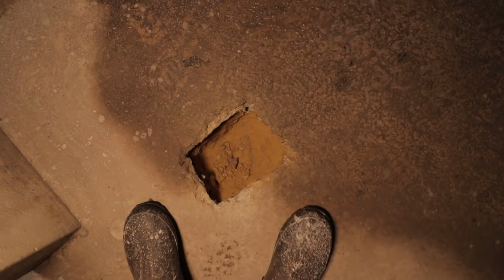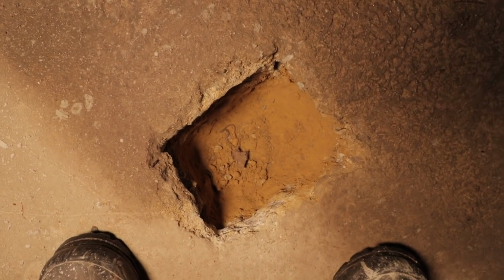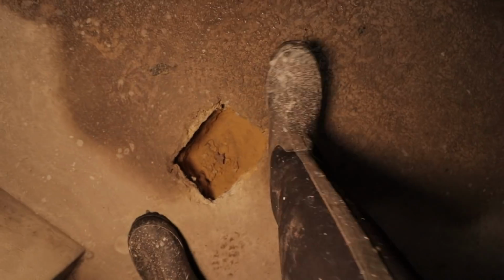So all I need to do is, obviously, I can't paint the floor and seal it just yet because it's too wet. So I may need to get a heater in here, dry that out. But if we're working on the vent and things anyway, there's going to be so much falling down that I might just leave the floor till right near the end, to be honest, because we've still got to work on this. So yeah, I've got to really watch that moisture getting in there. Luckily it's not puddling, but that will affect this whole base floor, so got to solve that very soon.